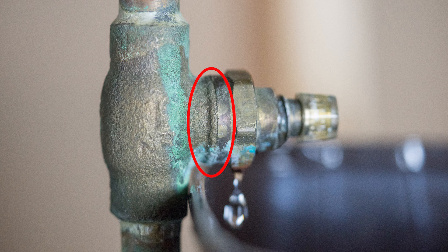In that case, trying to heat this up or using WD-40 won't loosen this at all. In the end, I think I'll eventually replace the valve altogether, but right now the leak is stopped by simply unscrewing it all the way. In this particular case, my valve does not have a packing nut.